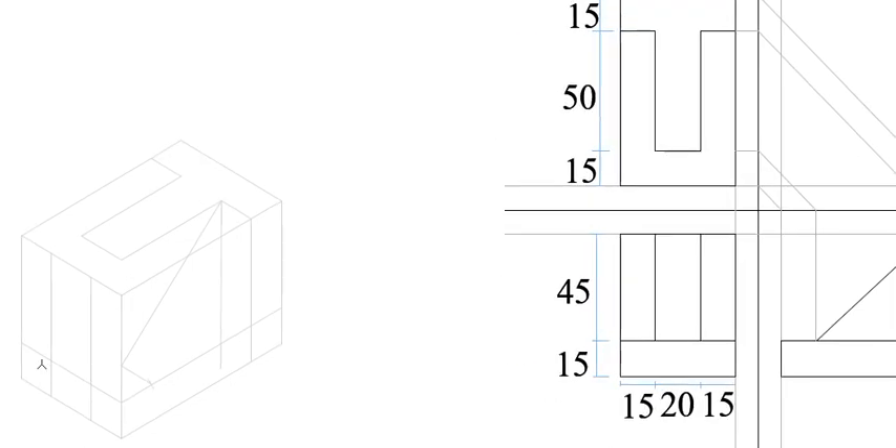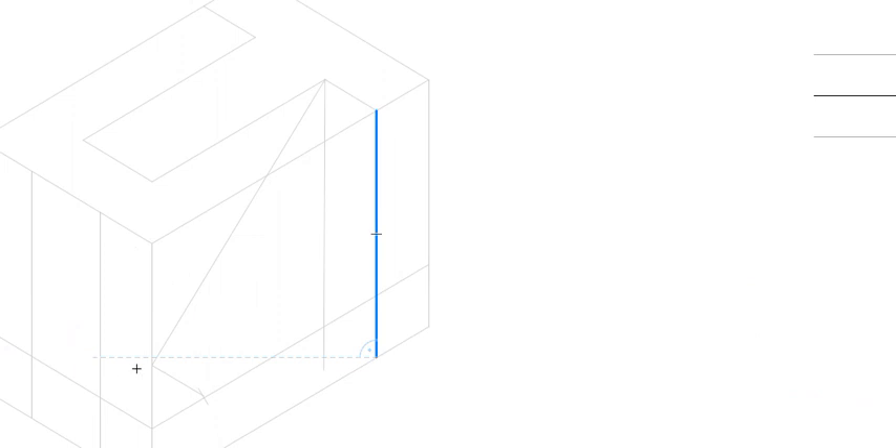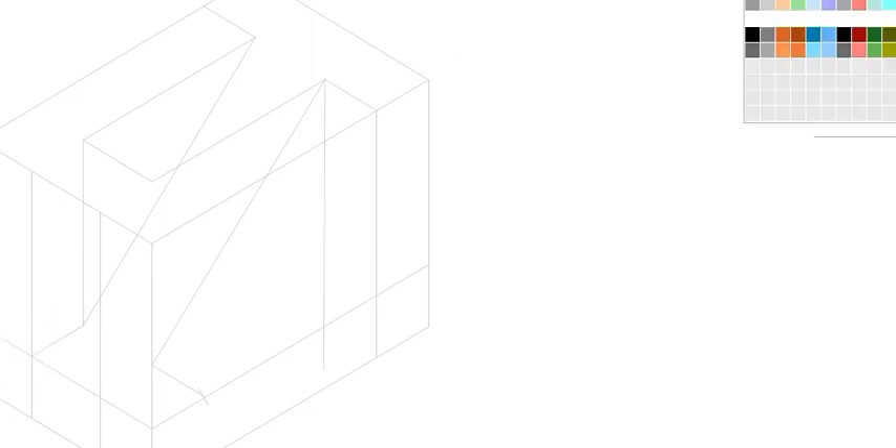Then the other point you want - draw another line from here at 30 degrees measuring 15 millimeters like that, and drop this one down where it is going to intercept - that is where you drop the line from this point. You'll have your elevation, your 3D model, looking like that. Let me now draw it using a darker pencil.